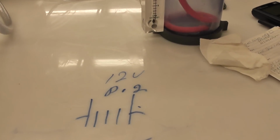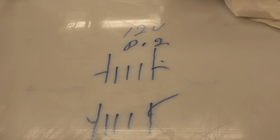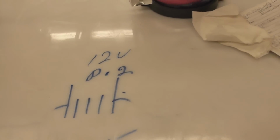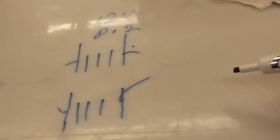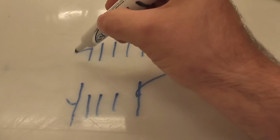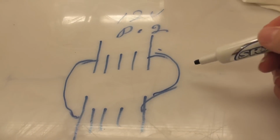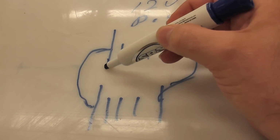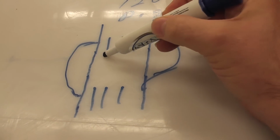You will drop in current, which is okay if you were putting it in a smaller car. As you could see, we were drawing a lot of power, and in a smaller car you'd want to use a smaller plate to control your current, not pulse width modulation. Okay, so what you're actually doing here is you got your 2 cells, and you add them together by tying these two wires together and these two wires together, all you're doing is this. You've just done that, okay?